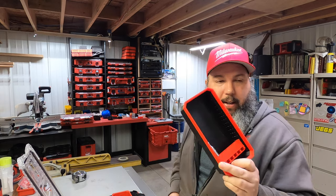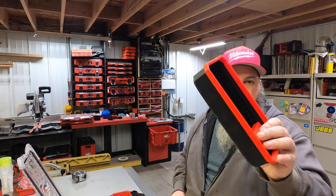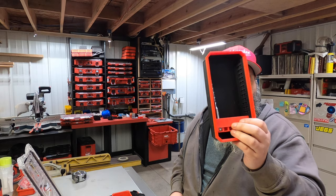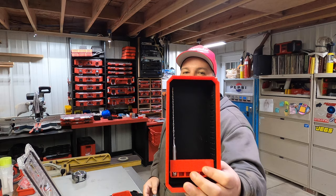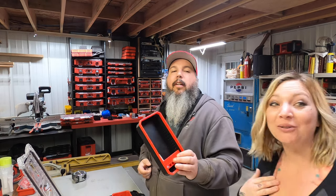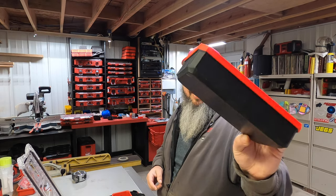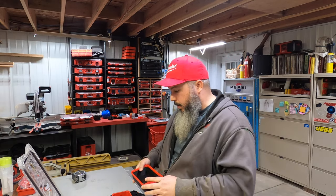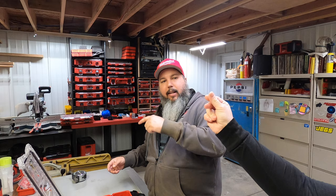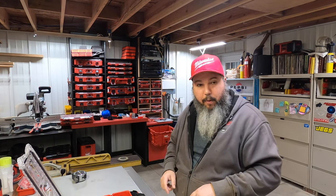I've tried everything except printing them on the Prusa in the G-code to make these pause, but the Enders will just fail every time. So we pretty much set a timer, stopped the print at that point, and changed the filament. They look super cool - but that means staying up till one o'clock in the morning to do the first set. So there you go - two colors. We can do some custom stuff, but it does cost more because you have to sit there and babysit the printer. If you guys want something like this, PM us - just be prepared that it's going to be that six-week time, not the four.